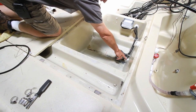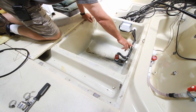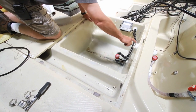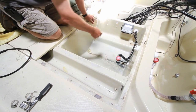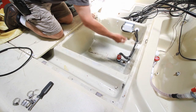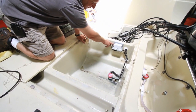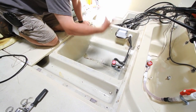where we're bringing water in. Water's coming in here. It's going to rise to a level where it's going to free flow right back out the top of the tank. Holes around this area in case a piece of bait gets caught. The water can still evacuate, but if it does get up to a certain point where it's too high, it's going to hit the high water float switch. It's going to pump the water back out and keep it at a nice level, but it's going to let it recirculate.